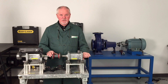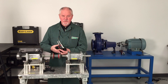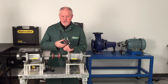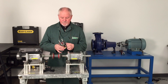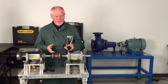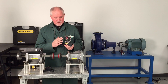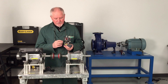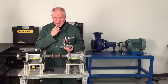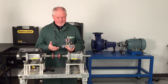My focus today is going to be showing you the system — a mid-range system called the E540. It has lots of features that you will like. I'm going to show you the simplicity of use, but first let me show you that when you take the detector out of the box it comes pre-mounted on a bracket. This is the detector; it has a beam that comes out of here and this is the detector slot — it's 30 millimeters in length, so that's almost an inch and a quarter. That's a huge amount of travel, so rough alignment is easily done on this.